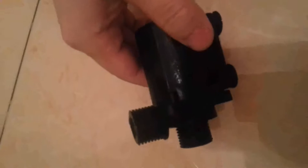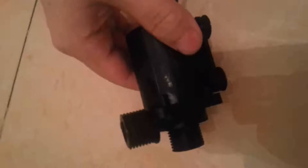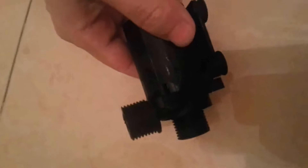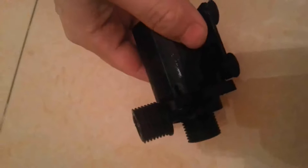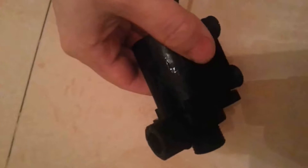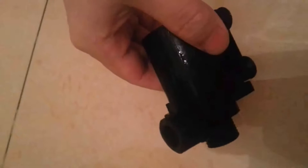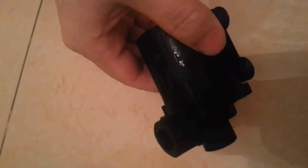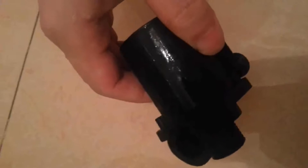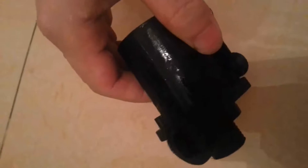This one in my hand is our new brushless DC pump. This mini pump is our HPP368F-A series. Its voltage is 24V, with max power consumption about 20W. So in such a small size and so low power, it can get a powerful pumping effect with quite no noise.